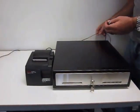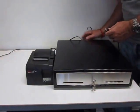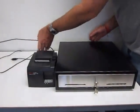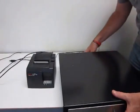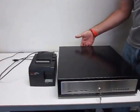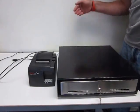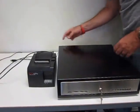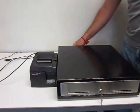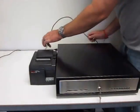It's basically just a standard telephone cord. Make sure you route your cables down through the hole. Ideally, you want to drill your hole in your countertop about halfway from the back of the cash drawer — if you're doing a two-inch hole, you should have maybe one inch hanging out and one inch underneath the cash drawer, so you can route the cables down real clean. These route nice underneath the feet as well, so you can hide your power cable, USB cable, and cash drawer kick cable.